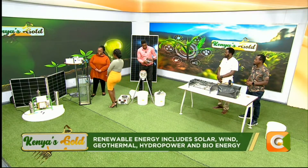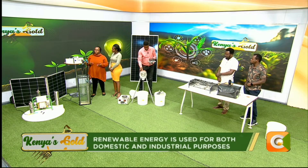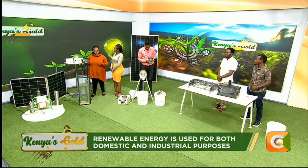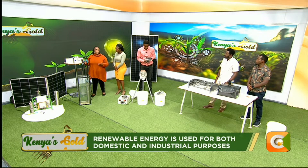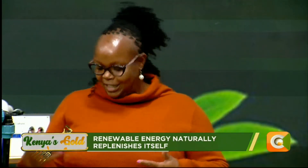The first one is that the water source is sometimes very dirty — like at times when it rains and the river has too much silt and debris that can block the pump. But most pumps also have technology to handle that, and there are filters which are provided at the time of installation to make sure that is not a problem. Another problem is farmers sometimes want to keep moving the systems.